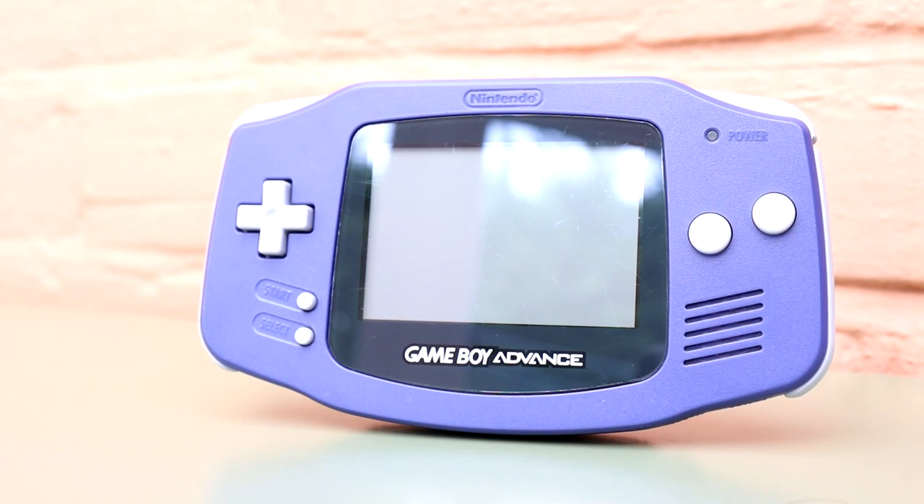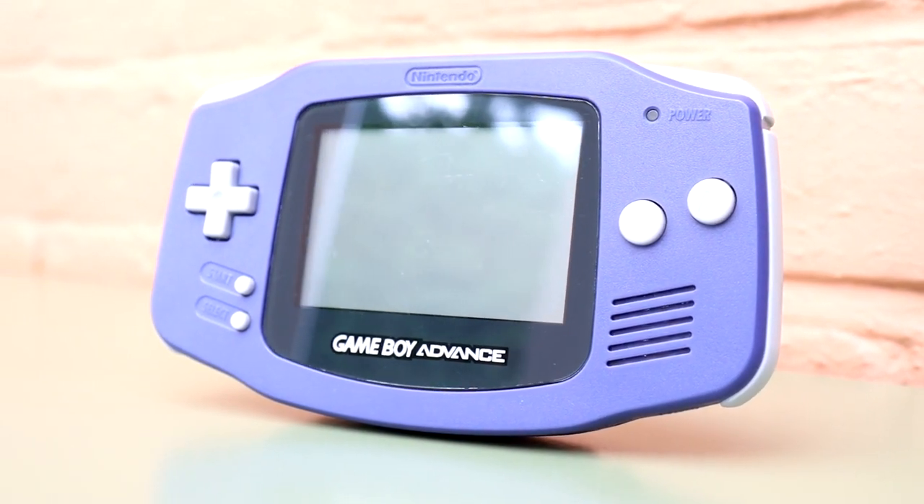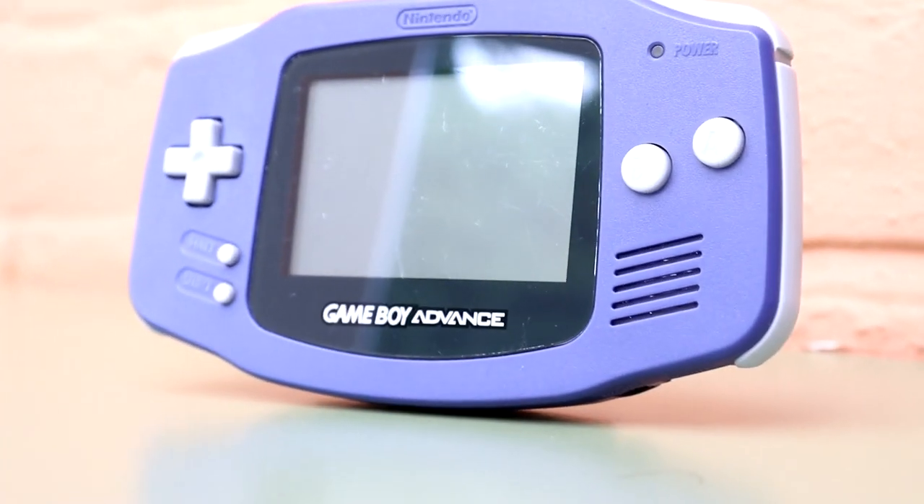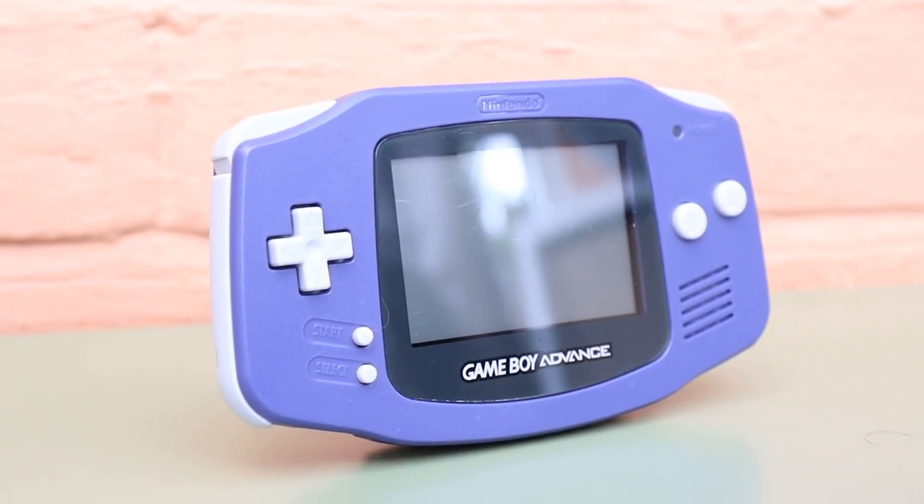Just to show you that it still turns on first time — on, off, on, absolutely fine. The buttons work with no issues at all. Start and select now work on games. A, B, and directionals always worked anyway, and R and L exactly the same. This might now be my favourite retro console — what a great little device. Just to confirm what we've done: desoldered the power switch to get apart the metal shielding and gave it a real good clean inside, and extended the metal prongs on the switch for a better connection. The start button issue was resolved after a good clean to remove oxidisation on the contact. The Game Boy was a bit grubby so we gave it a proper clean and it looks practically brand new. I won't be getting rid of this — for £25 to have such a nostalgic device look and feel incredible is priceless to me. I'm considering an IPS screen, so let me know in the comments whether I should keep it original or get a new sticker and add an IPS screen. If you enjoyed this one guys, make sure you hit that thumbs up button — subscribe if you're new, and I will see you in the next one. Peace.